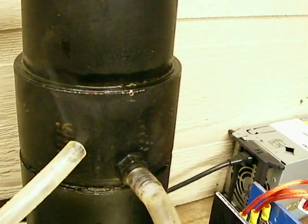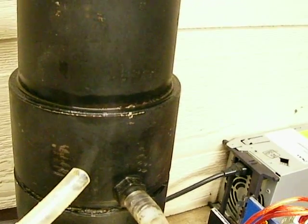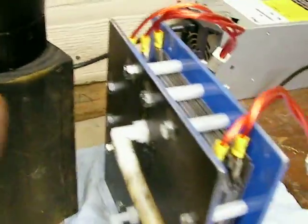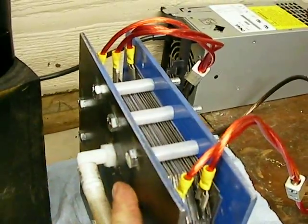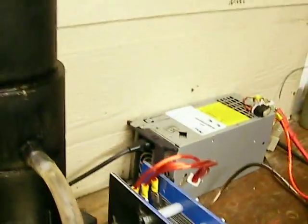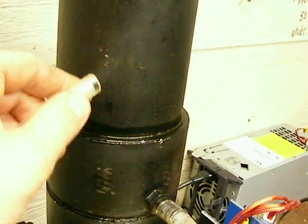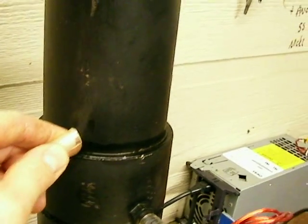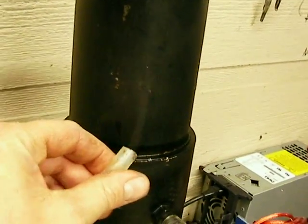This output is at 18 amps at 11.14 volts direct current. This hose is cold — it is not warm at all. The cell is not even warm; it's a little bit below room temperature. This is 1/16th inch plate spacing, 21 plates, three negatives and two positives.